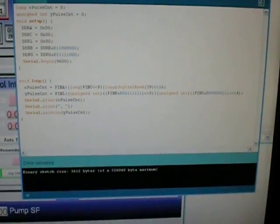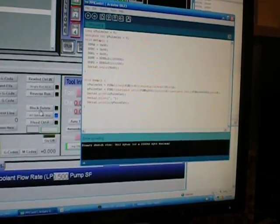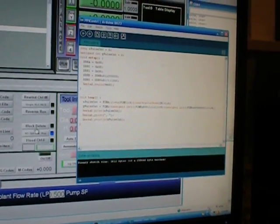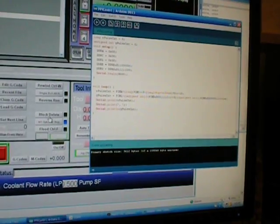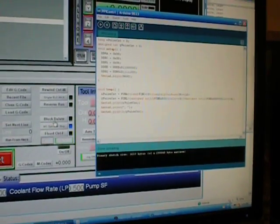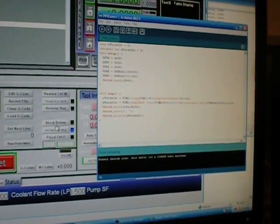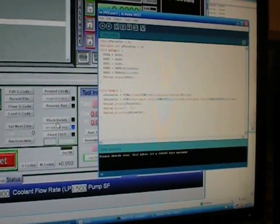So the advantage of having such a hardware integrated system is that I will be guaranteed never to lose a step. That Smooth Stepper can produce pulses at 2 megahertz frequencies, which at 16x microstepping, which I have on this machine, amounts to about 70 meters a minute travel. So there's a potential there for very, very high speed counting and integration if I could get a higher speed microcontroller. Again, at those kinds of speeds, our 40-watt laser wouldn't produce very much burn in the material, but it's at least under development here.